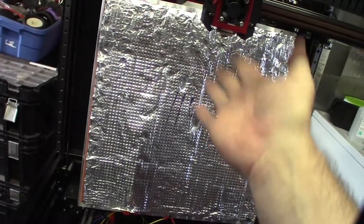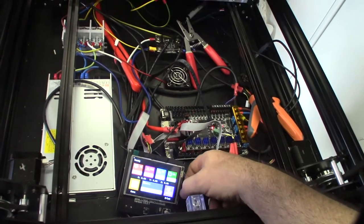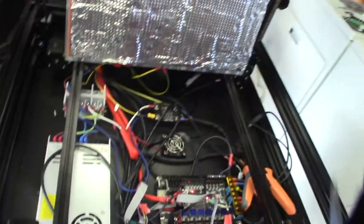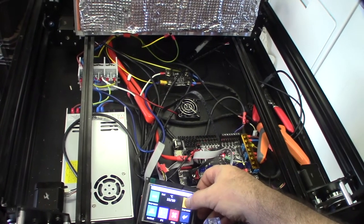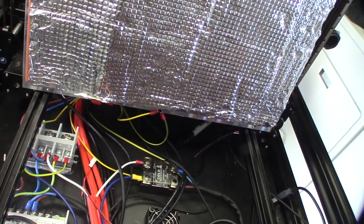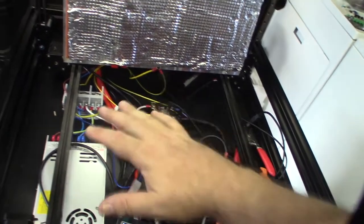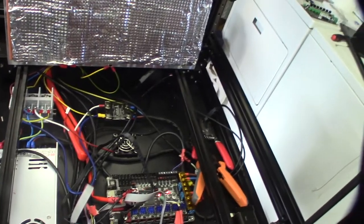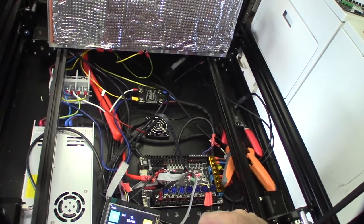Out of the box the touchscreen works. There's enough basic firmware on there to control things — I can see the hotend heating up. I should probably get the board off AC control. The bed has a separate AC solid state relay setup, and normally if the bed output is working I'd expect an LED to illuminate on the MOSFET. The bed MOSFET is tiny — you can't control a really big bed with that MOSFET, so it's controlled by AC.